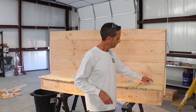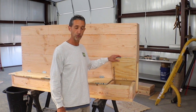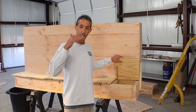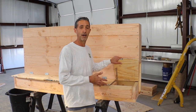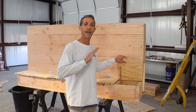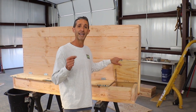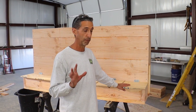First thing would be the bolt size for these front flaps. It was way too long for what we were doing. However, I did have a grinder. All I did was grind these down, that way the pig's snouts don't get caught on those bolts. I was able to grind those down because I also didn't have lock nuts. Grinding that down and then using a file, I was able to file them kind of flat, mushroom them out just a little bit so that those nuts can't pull back out. Either way, we're gonna have to be replacing these once a year, maybe every couple years anyway.